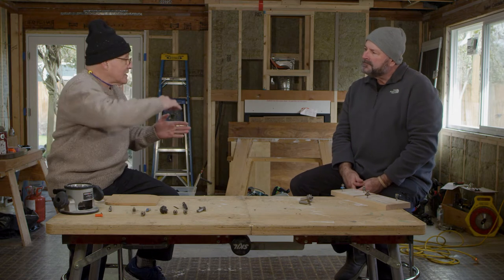Where you run into problems is with something like a handle hole — you're going to have to slow down when you make the corner, you can't just keep going at a reasonable feed rate. So normally you'll find that corners do burn. Changing the speed might help. What we teach students first is if we can get away from sandpaper, we will. A cabinet scraper does a pretty good job of taking the burn off. But sometimes it's the fact that the bit's not sharp — there's a variety of things at play. A light sanding is usually perfectly fine.